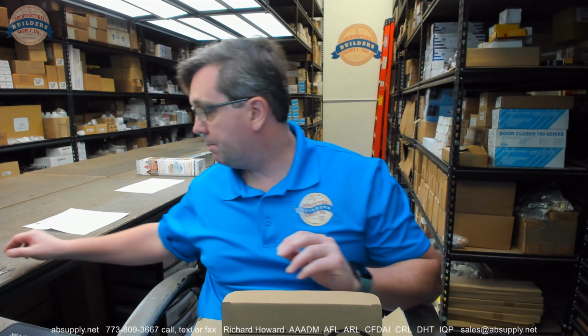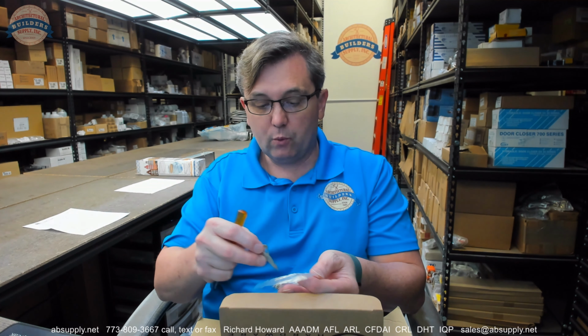No replacement parts when you're dealing with imported locks. No chance for that at all. There are no parts drawings, no manuals, no technical support. And the moral of the story was, just because the lock is a grade 1 lock, that does not mean that it's appropriate for use in an application. While it might be a million cycle, a grade 1 lock doesn't mean it's appropriate for a college campus.